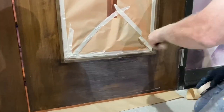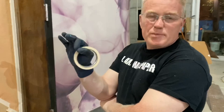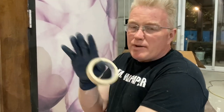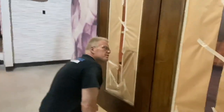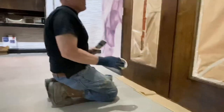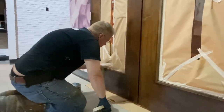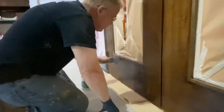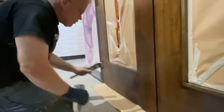After the door is installed onto the frame of the doorway, I sanded it down. After each sanding, I blow off the dust with a compressor and use a tack cloth to get any dust off the door. Then I take cheesecloth, roll it up just like you would a rag to clean something. I dip it in the Varathane — and I'll show you a picture of the Jacobean stain in this video. I don't put it on sopping wet; I squeeze the cheesecloth in my hand to disperse the liquid stain throughout it.